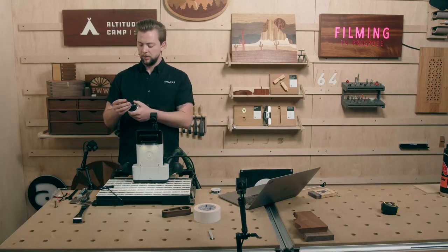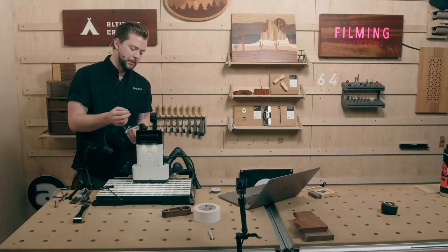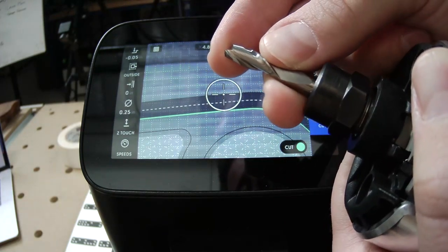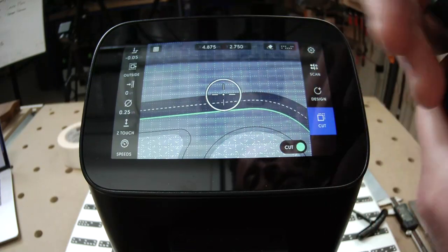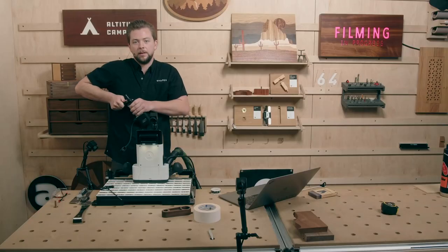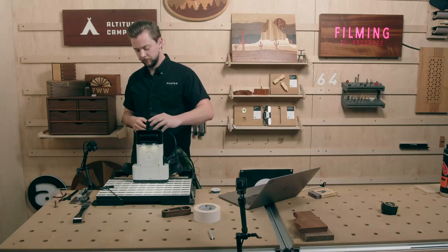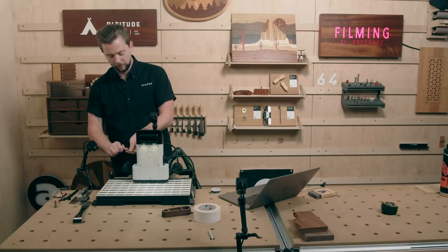Now there's nice grooves cut into this bit, and I want you to clamp it up into the collet right where that groove stops. Just sneak it up to that point. Don't go any further, and you don't need it sticking out super far. This way only the usable part of the bit is sticking out. And don't forget to tighten that up.